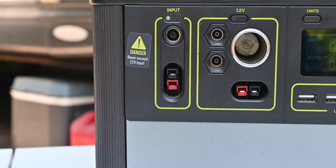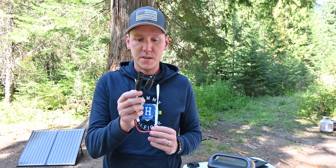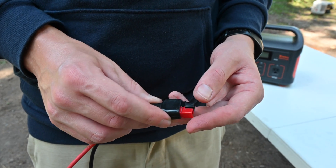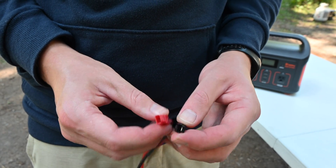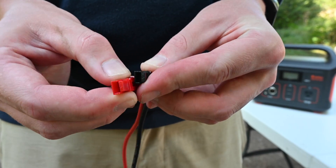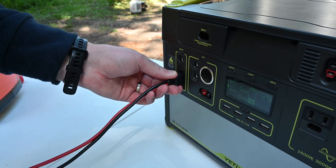Now let's talk about the Anderson input. If you're going to connect more than 120 watts of solar, you do want to use the Anderson port on the Yeti, because the 8mm port can only do 120 watts. This is the adapter we need for that port — it has the female MC4 connector as positive and the MC4 male connector as negative, and on the other side the Anderson Power Pole connector. When you buy this adapter, it might not fit the orientation of the input port on the Yeti or Jackery. So you slide the connectors off of each other — they sit on top of each other and slide together — turn them the correct way for the Yeti, slide one on top of the other until you hear it click, put the sleeve back on, and now it will fit into the port on the Yeti.